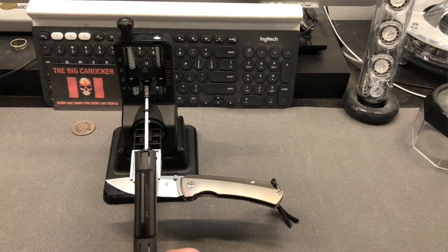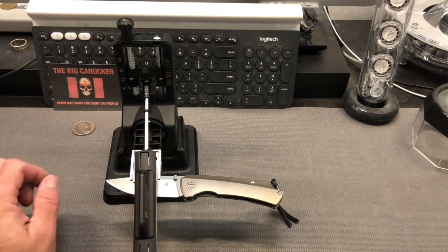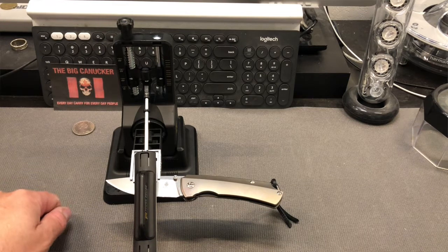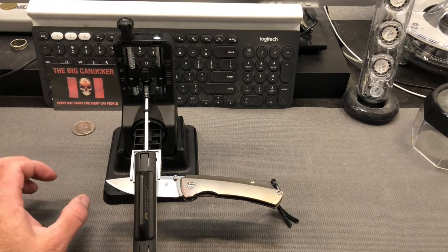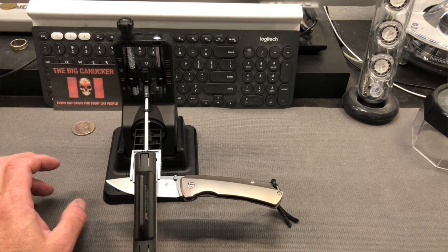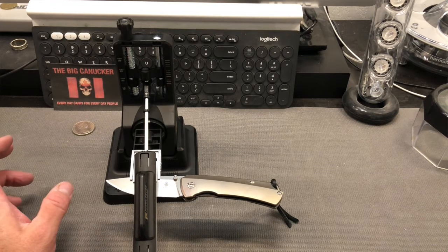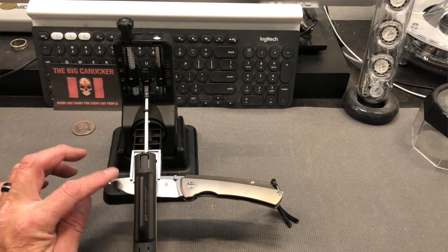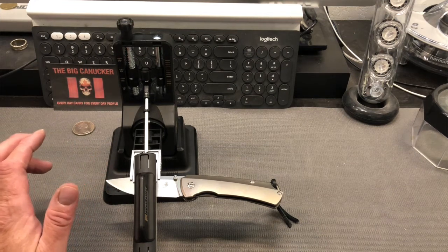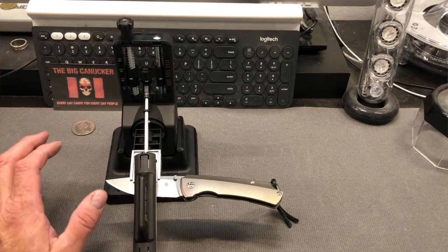And I'm going to say that you have a thing called a BESS sharpness tester, and it is basically a little thread that you cut, and it measures the amount of force it takes to cut through a consistent thread. Now, something that is extremely sharp, like your average utility razor blade, is a little over 100 BESS, say 125 or so. Well, this here is routinely getting knives down to 80 to 120 BESS, no problems. So that is still extremely sharp. That's like straight razor sharp.